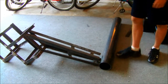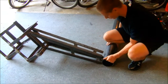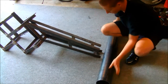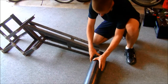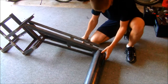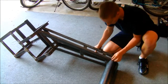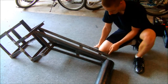So we get that piece of tubing cut, and this is going to mount up in there. We're going to put this up against the side of this like that, draw our circle matching with the tube, then cut those pieces out so the tube and these two pieces mesh up nicely, and then we'll weld all the way across from this.